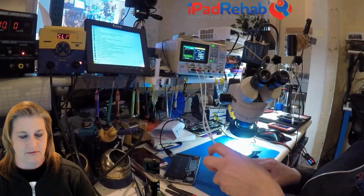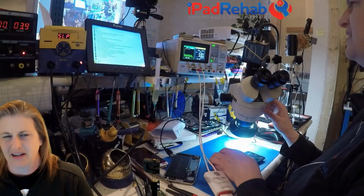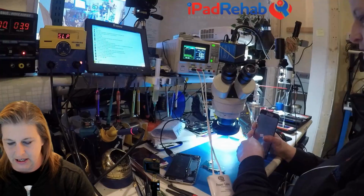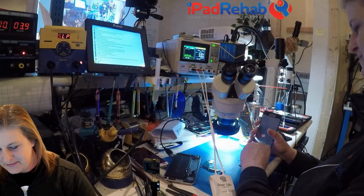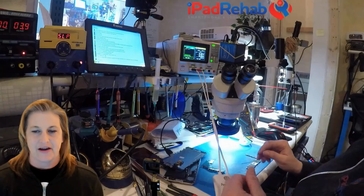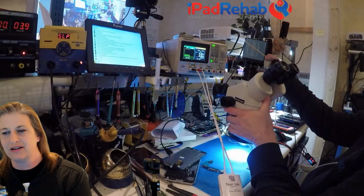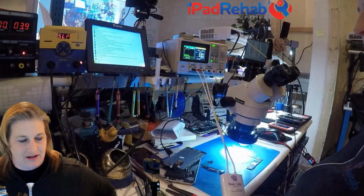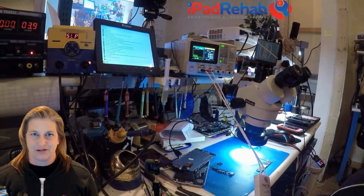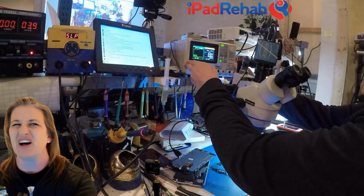So let's see if we can use that to our advantage to try to find out, is there a short circuit? Now, I've already looked at this board a little bit because it's more fun to do a stream when you have a little bit of an idea where you're gonna go. So my next step would be to probe around and see if there are any known lines that go bad. So I checked for shorts on 3V0 NAND. I checked for some of the power management chip outputs, and I didn't find any short circuits. In fact, I checked around this board for a while and I didn't find any short circuits, but there's heat.